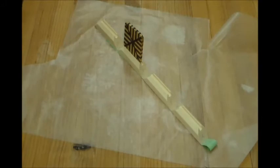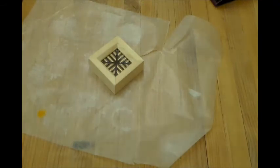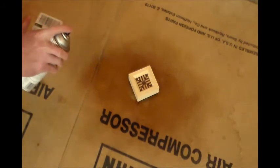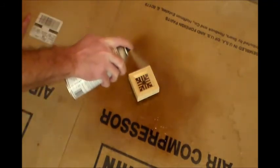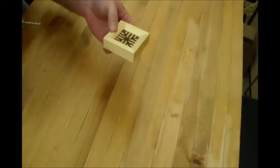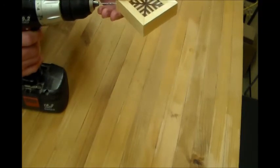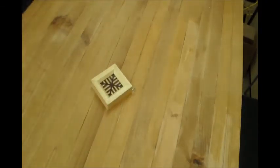Just a little bit of glue. Take the tape off. Give it a light sanding. We're ready for a couple coats of lacquer. Now that the lacquer's dried, all we have to do is put on the finishing touches — basically, drill a hole for the eye screw. And there you have it. Using just ordinary construction materials, we were able to make this little Christmas ornament that any woodworker could appreciate.